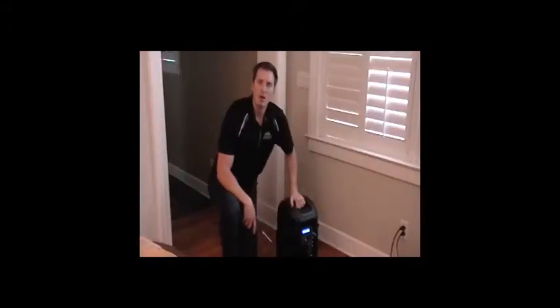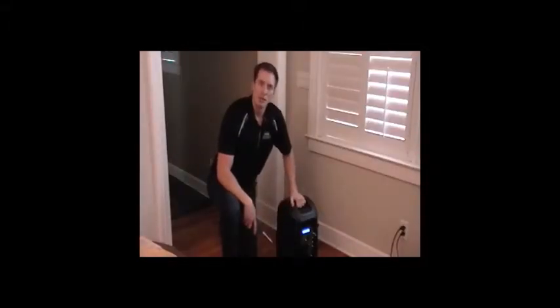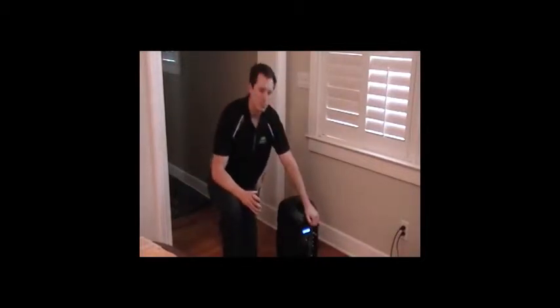So how do we know how well our approach is working? We're going to play white noise through this loudspeaker and measure it in the bedroom with a Class 1 SPL meter to determine how much sound is coming through. We'll be turning up the noise as we go.